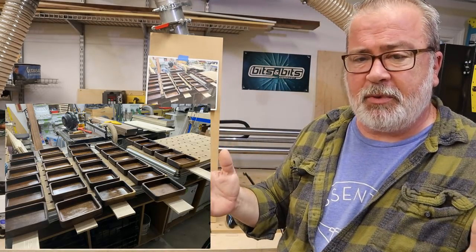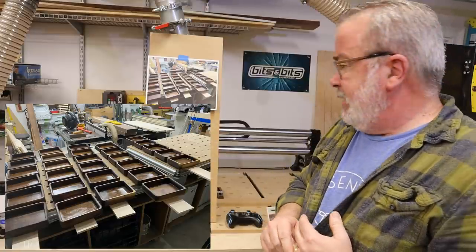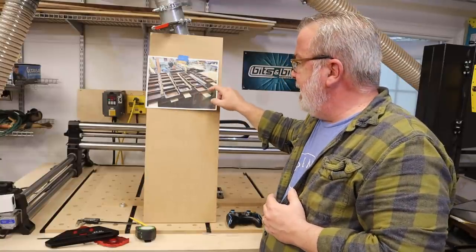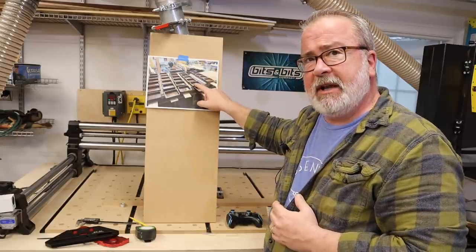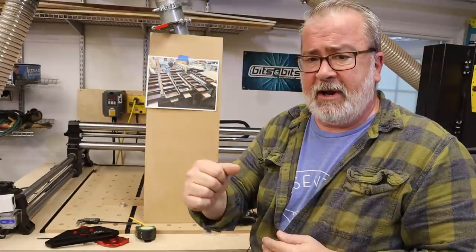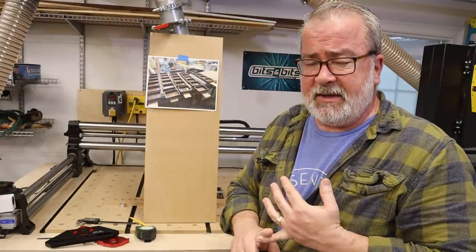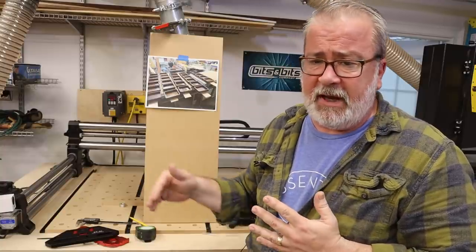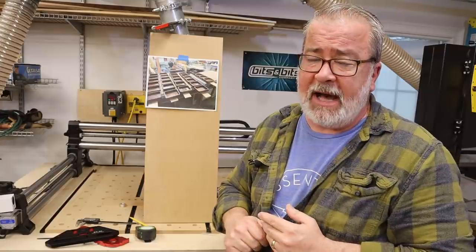As work was coming off the machine, I could begin a post-process touch-up — a few licks with some sandpaper and you're all set. The depth and the profile cut, especially as you get around the corners, you're prone to some chip-out as you transition from the edge grain into the end grain. The CNC delivers a very consistent tool speed in terms of rotational speed, but also the feed rate — how fast it's going around the different corners. So it's very easy to create batched workflows.